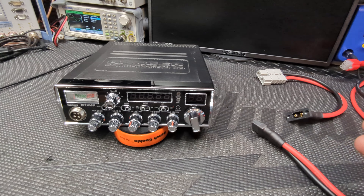What you could do is have a cord made where the ends are going to be exactly the same — you'd have an XT90 on one end to go into the radio and then another XT90 on the other end of the cord, where you would normally have ring terminals, and you'd just plug it into the panel mount. Then say you were done running that radio for the day — you could just unplug it, take that cord, wrap it up, and get it out of the way.